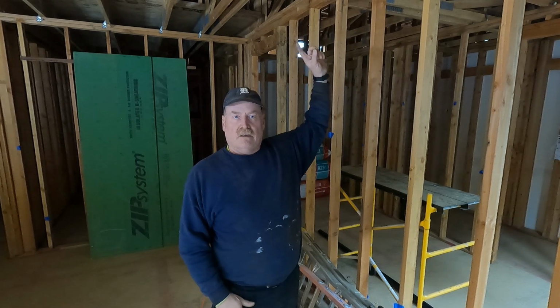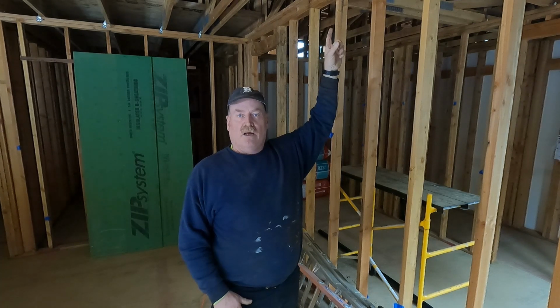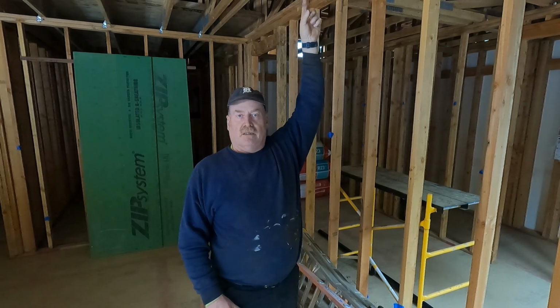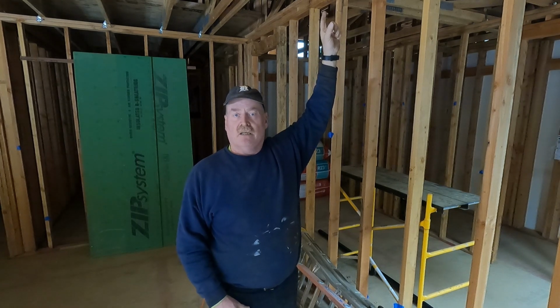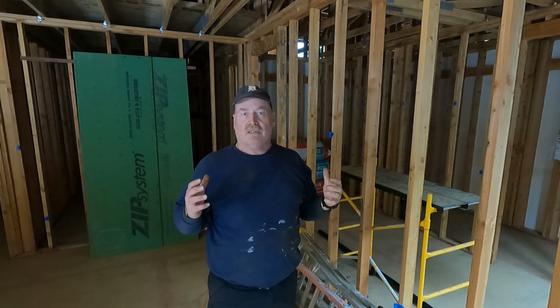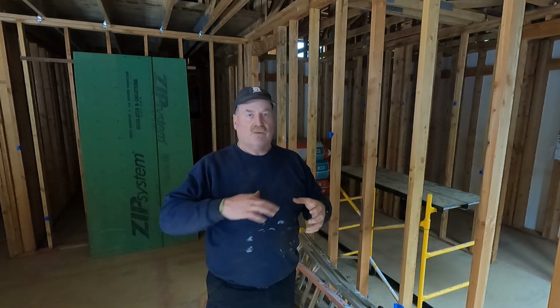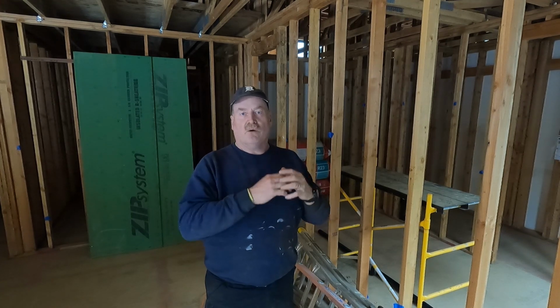And then on this side of the house, I'll have the plumbing vent go up, as well as the HVAC vent will also go out the same false chimney that I have over here. So then I only have basically two holes, if you want to call it. I mean, they're big, but they'll all be flashed properly, and it won't involve a rubber boot with 30 screws going around it. So let's get started on the venting, and I'll show you how we're going to pull all that together.